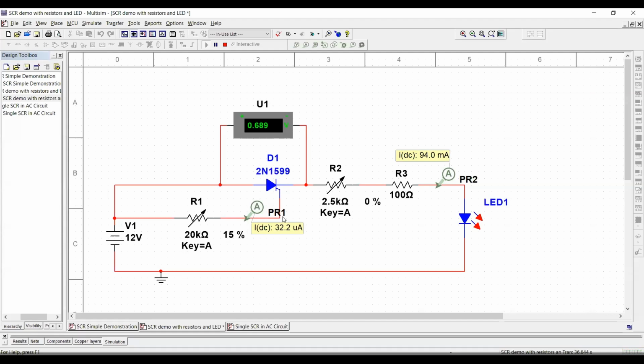Now, as soon as we get, did you see what happened there? We were not able to see that we got to the 2 milliamps because as soon as we got to the 2 milliamps, this LED was able to turn on. Okay, I'm going to show you that once more. I'm going to turn it off. I'm just going to show you the last part. Okay, so let's look here. You see that we have 1.36 milliamps. Can you see there? Now we have 1.58 milliamps.